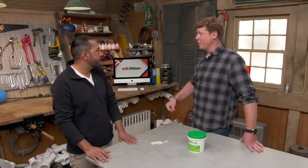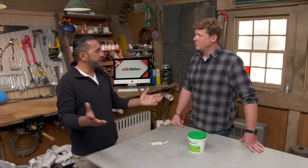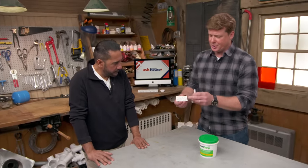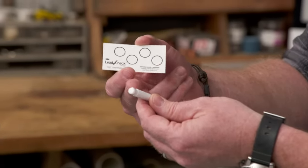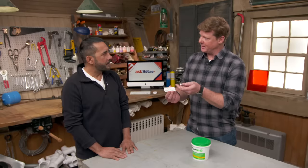But that's fine because that wood was perfectly prepped and ready to go. She has nice beautiful trim — all she's got to do is lightly sand, put a couple coats of water-based no-VOC polyurethane and she's done. Something I had not seen before was this secondary lead test — you were hoping not to see red or pink on the tip when testing the paint, yet hoping it turns red or pink on the secondary test card.